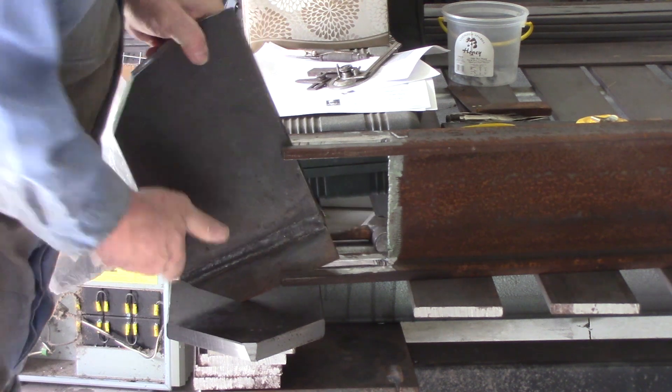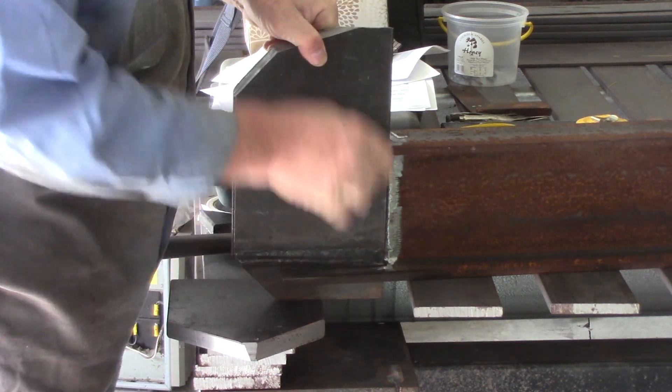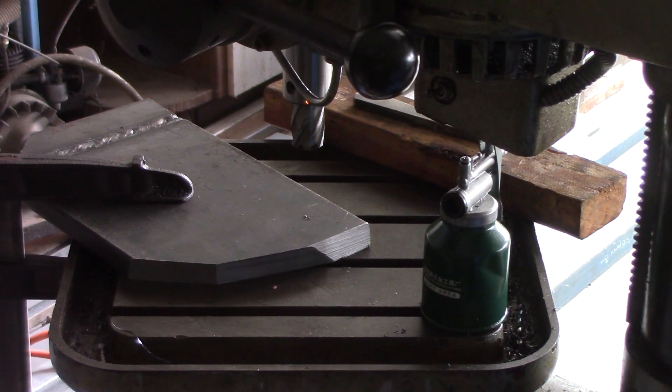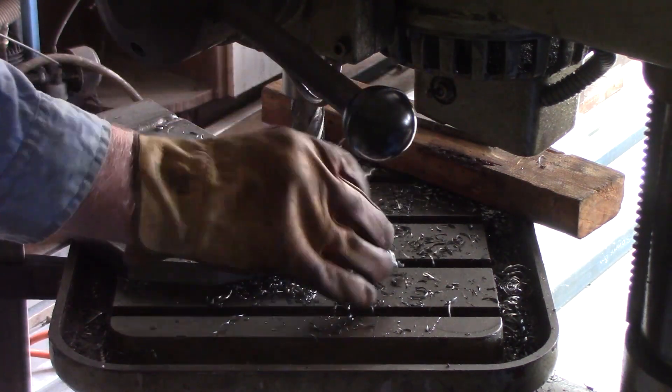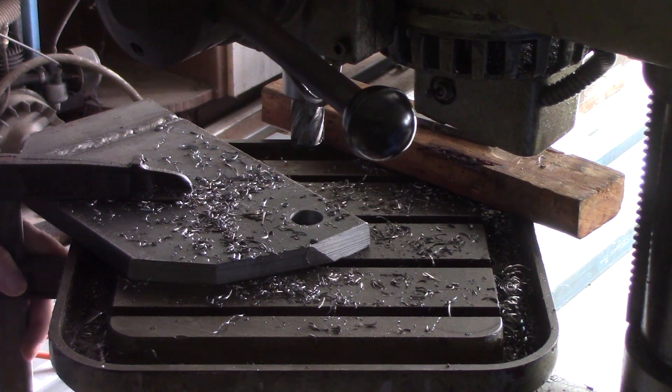Now this is the horn that we'll attach the ram to, and it fits right here in the slots that I made. It'll have to be raised up a little bit to fit, but before I put that in I'm going to drill the holes through it, because it'll be impossible to manhandle that under the drill if I weld it in first. I've got this all lined up and I'm putting a 26mm annular cutter down there, because I need to put a 1-inch pin through it. That's 25.4mm, so I'm leaving 0.6mm as tolerance — roughly about somewhere between a 64th and 32nd of an inch. Always put gloves on before you're grabbing hold of this stuff; it's like razor wire. That's it for that piece — I only need the one hole in there.